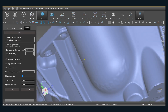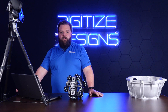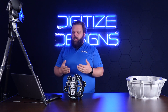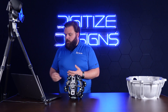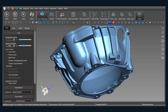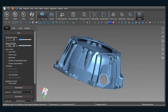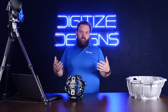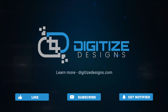Once we've got that point cloud aligned together, we hit wrap, which creates a mesh. If you zoom in really close you can see individual squares — individual points represented as squares. Wrap connects the dots between those points and makes this into a polygonal model, a full surface instead of discrete points, commonly saved as an STL file — same kind of thing as with 3D printing. That's usually what we're outputting to go into reverse engineering software, inspection software, or something like that. Here's our finished mesh — that's ready to go into whatever your downstream application is. If you're interested in learning more about the Nimble Track or anything else we do here at Digitized Designs, feel free to contact us through our website. We'd be looking forward to talking to you — thanks.